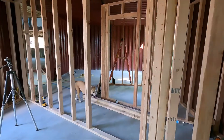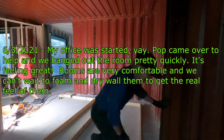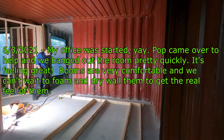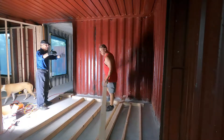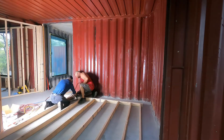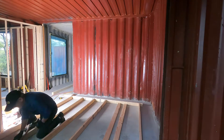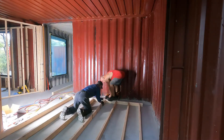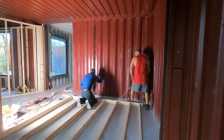Our prior house had a much smaller office, so this is a great upgrade. On June 3rd, Pop came over and we started working on my office walls. It's a pretty straightforward build with one angled wall on the left. Pop's looking at the tape on the ground as we plan the wall layout. All the rooms use 93-inch studs plus one-and-a-half-inch top and bottom plates, so it's 96 inches to the ceiling. While I went to cut some wood, the wall actually tipped and hit Pop on the arm — he's 85 and a tough guy.